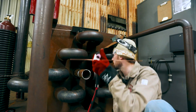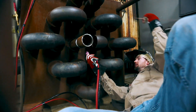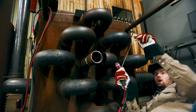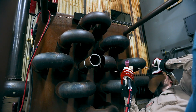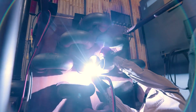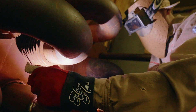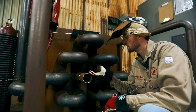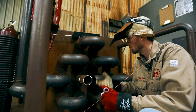Let's get down here on the bottom. In a lot of these welding spots, you're going to have to pre-plan the way that you do it. I've done this specific convection box here at KWI before, so I kind of know the route to take and how to move my wire. You'll be in situations where you have to make these welds in a tight spot, and at first it can be very nerve-wracking if you haven't done it before. That's why it's super important to be doing these welds with someone who is experienced and with a company who knows you're trying to learn and get better.